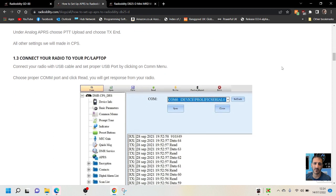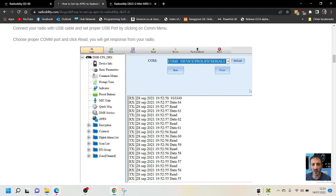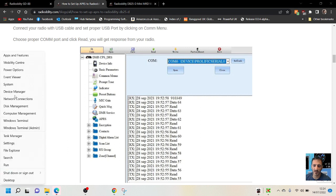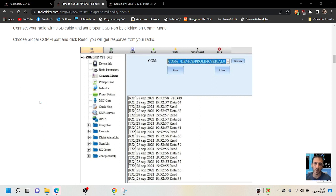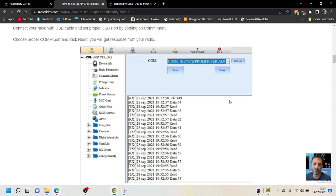Now go to the CPS — I'll also have a link in the description. Connect your radio via USB cable. Set the proper USB by clicking the COM port here — you get a dropdown, choose the proper COM. To find your COM, right-click and go to Device Manager. I'm on Windows 11, Windows 10 should be fine too. It'll be listed there — probably shows as GD32, or on here it shows as a Prolific serial device.